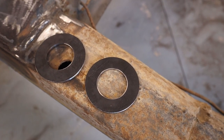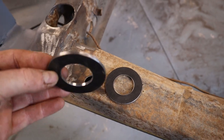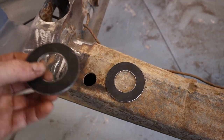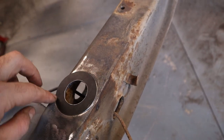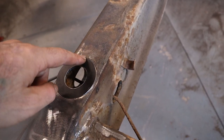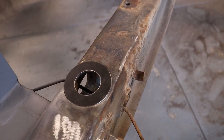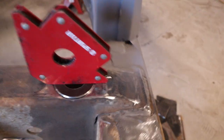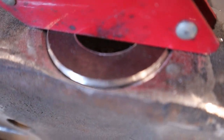Okay, so I just got these washers made up out of three mil plate — CNC plasma cut. A machine shop around the corner cut them up for me. They just slot in there, a little bit tight so we'll have to grind a little bit off. I'll put a 45-degree chamfer on the washer and also a 45-degree chamfer on the chassis as well — that'll allow the weld to penetrate so it's nice and strong being a mount. Okay, so it's sitting in there nice fit, got the 45 on both sides so there's a nice little valley in there for the weld.